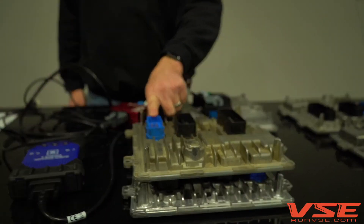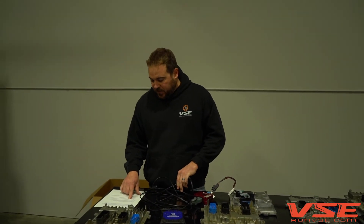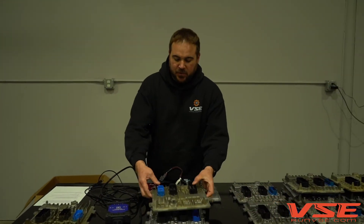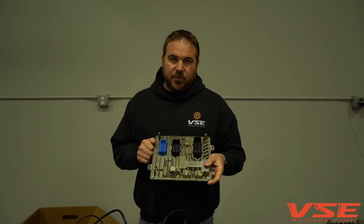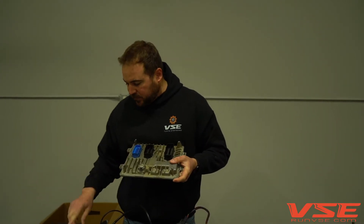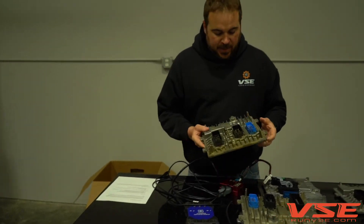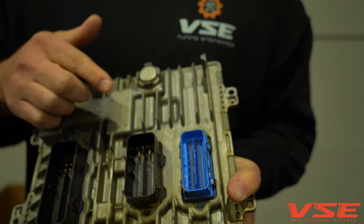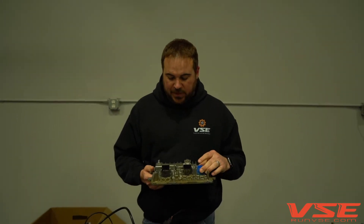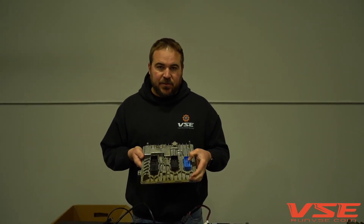What we're not going to do is repair an ECM that has sustained impact damage to the front or back of the case. We understand the E41 has some sensitive micros in there — if it's been dented, damaged, or we have questions on ECM boot-up, we're going to send it back, because we don't want to repair something that could possibly be junk and waste your money. We're also not going to repair an ECM connector with a broken center divider plate. We have literally hundreds of these ECMs on site and we see what happens — it's a super sensitive repair between ECM pins and we just won't run that risk.